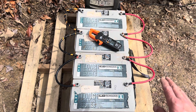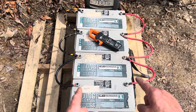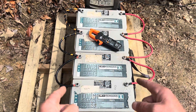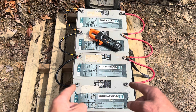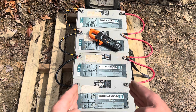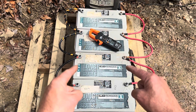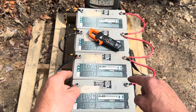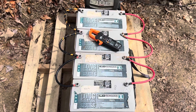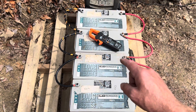I'm going to show you charging. A lot of people set their batteries like this with the daisy chains and they'll hook their charger to one end. What happens is your current you're pushing into the batteries - this first battery is going to get hit the hardest, this one's going to get a little bit less, that one a little bit less than that, and then the one on the end is going to get the least amount of charge. I'm going to demonstrate that with this amp clamp and charger.